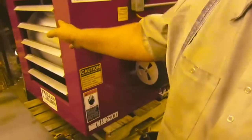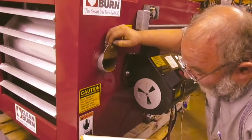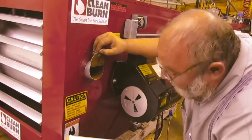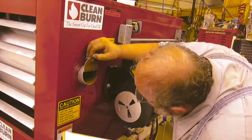A few safety precautions here. If you use this video you are agreeing to use it at your own risk. Be sure to let the unit cool down and clean the ash out of the unit, especially when the unit is soaked with oil and antifreeze because it can burn uncontrollably. Do not stick your head near the peep door until the flame is established, because if the heater is hot and the chamber gets filled with oil fumes and then the hot fumes light, it will explode in your face.